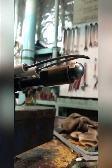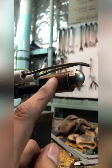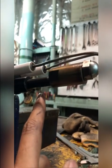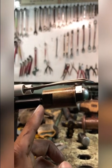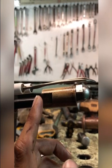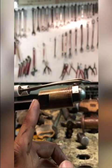You should also check that the electrode part is away from all other metal parts — it's far away. Also, put Teflon tape here, because while working, when the pilot burner pump starts, there will be a diesel spray from here. A spark could occur there without you knowing, resulting in no ignition.